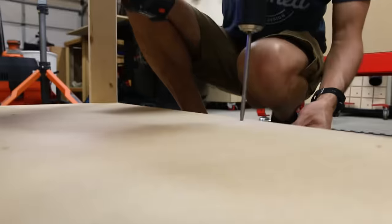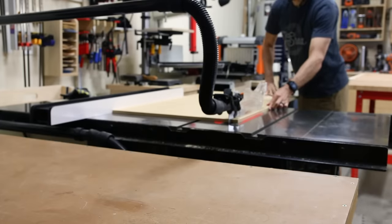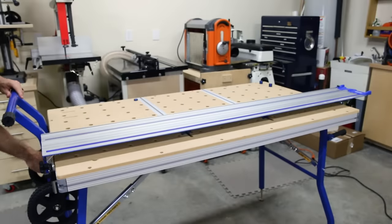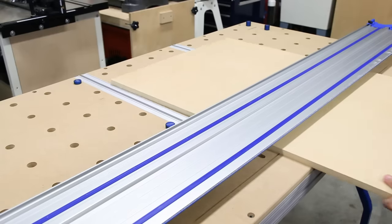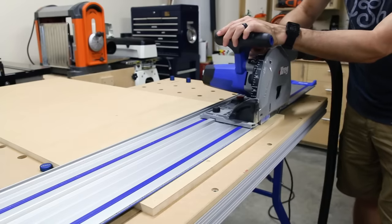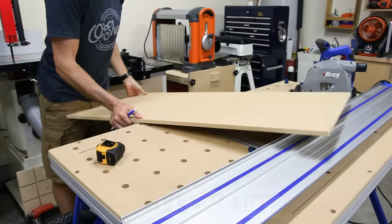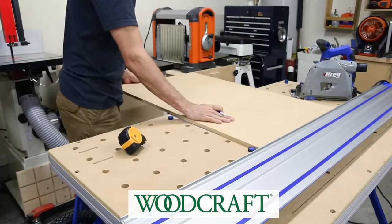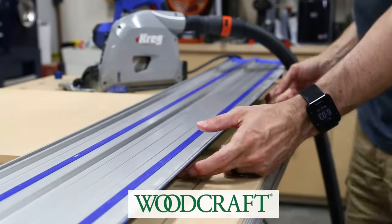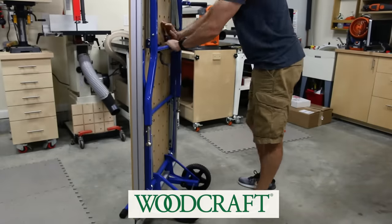I'll use the back area to store a dust vacuum, a computer for my CNC, and accessories for the CNC laser. Next I needed to cut the leftover shelf piece to fit the pullout tray. I ripped it to its new depth on the table saw but the panel was too wide for my sled to cut. This is the perfect spot to use the new Kreg Adaptive Cutting System — it combines a track saw and a collapsible workbench with registration dog holes, letting you use the track for straight lines or set stops at 90 degrees to make square cuts on wide panels. The Kreg system and all the Kreg products used today are available at Woodcraft, the sponsor of this video. I'll have a link to all the Kreg items and supplies in the description. Thanks to Woodcraft for sponsoring this video.